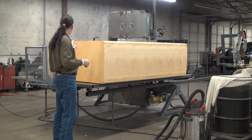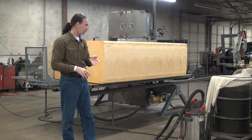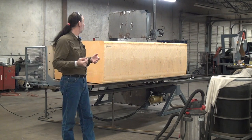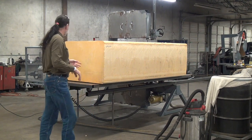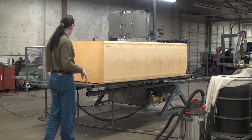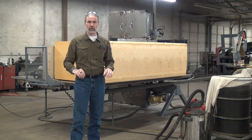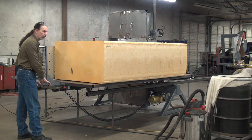It has a large traveling table. This machine has all the interlocks: cabinet interlocks — open a cabinet door and the saw won't run or turns off — a blade breakage detector, a low air pressure switch, remote e-stops, table mounted controls, and a manual table traverse.